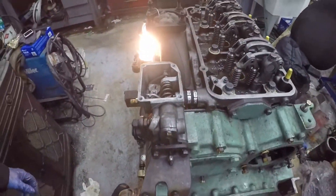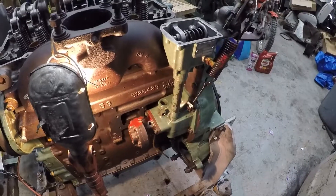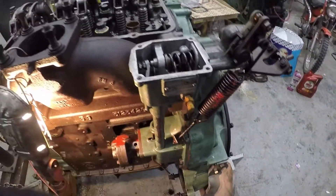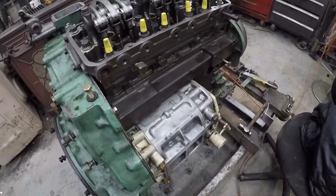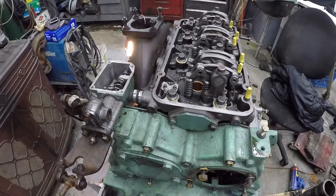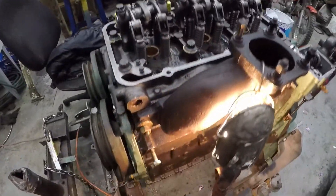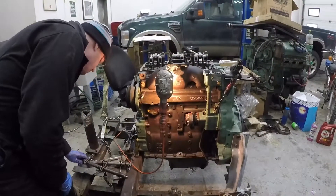The governor's in now, so all I've got to do is check the backlash and hook up the oil line. The blower's in as well. The next video is the oil cooler, and then we can work on the overhead, put the control rack in, and the injectors and whatnot. I'm going to change the rack to a safety rack.